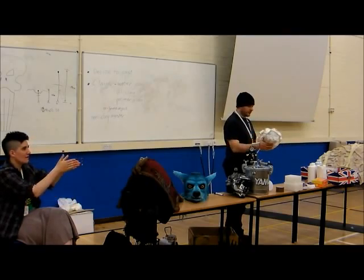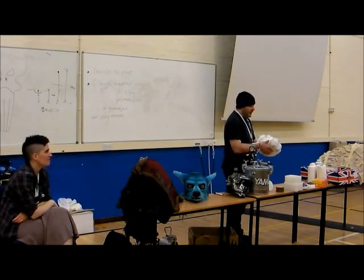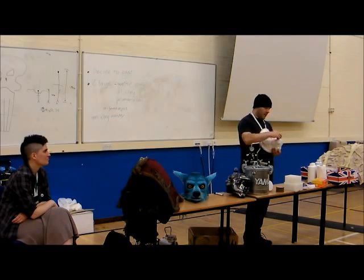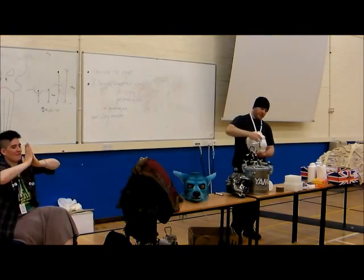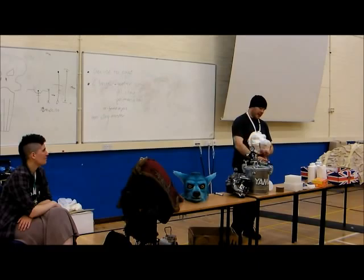I mean, there's other ways of doing the join. You can build up a wall so it abuts. You can overlap it with the backside. There's different ways of doing it. Another way is what's called a walled method, where rather than doing these overlaps, which we do because it's quick and simple, after you've done the mould, you can make a little clay wall. And then you do the plaster up, so the plaster comes up like a little L shape. Then when you come to make the second part, you pick away all the clay, Vaseline the inside edge, and then do that.